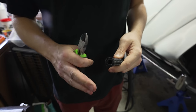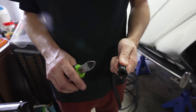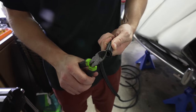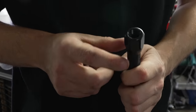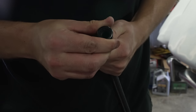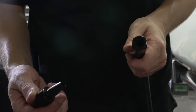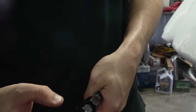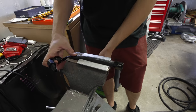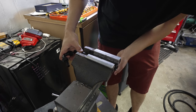Sometimes we'll cut this with a four-inch cutoff wheel but it leaves dust you gotta trim. The best way to cut this is with a big hose cutter from Harbor Freight. If you have little hairs you can take a pair of dykes and try to trim this off. Now you just push the hose all the way in until you see the hose butt up with the threads right there - I usually pull it back just a hair, because if you're all the way in it'll cause you to bind up. That's sitting nice and flat. Then you take the other piece of the end fitting - it's tapered, it goes in, push that into the hose, and then start threading this in. Put a little anti-seize here before you thread this in.